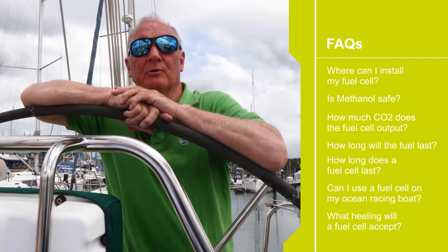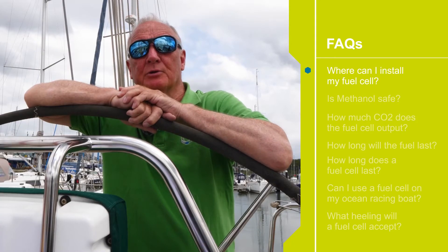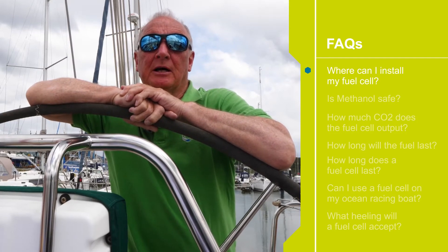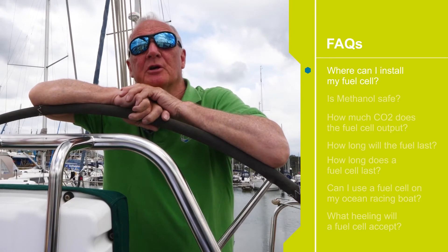We've got a few questions that people often ask about installation on boats. Probably the most common is where can the fuel cell be installed. Given that there are two outputs apart from power to think about, it's really pretty straightforward. One is water vapour — it can be taken over the side as shown, or alternatively some people drain it into the bilge; it produces maybe an egg cup full every couple of days. The other item is heat, which needs to be taken into a compartment that the fuel cell is not in. Some people are content to duct it into the main saloon — that's perfectly acceptable. You can position the fuel cell basically anywhere as long as the heat doesn't get returned straight back into it.